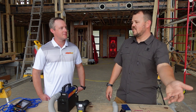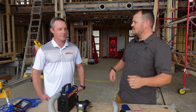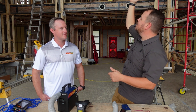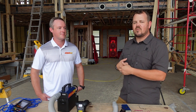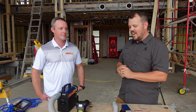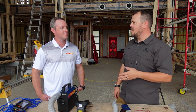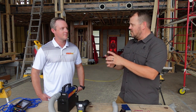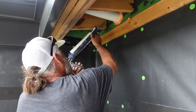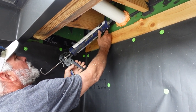Pressure-plane wise this is as low as we get, and it probably has some of the highest infiltration pressure. We went from that to the highest exfiltration — this space is 27 feet tall. This house has concealed gutters all the way around, and those concealed gutters come into the building envelope, so the plumber has been up running three-inch PVC. Sam was able to poke that hose way up high and we immediately found that they hadn't flashed or even insulated around some of those yet — not that they weren't going to, they just weren't done yet. We found three-inch PVC going through a five-inch hole that was just wide open while we were running a blower door. It's the quickest way to screw your blower door number: not being done with your air sealing. And we wouldn't have found it without the fog.